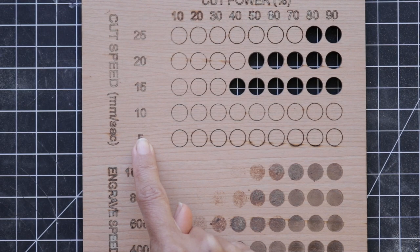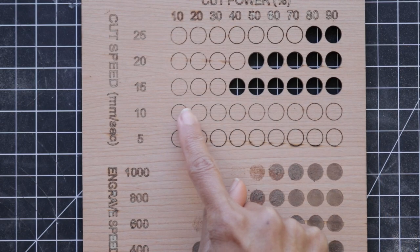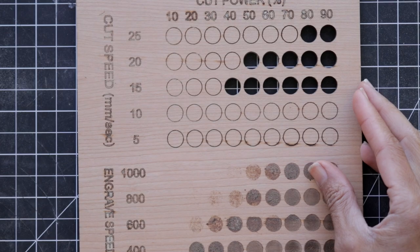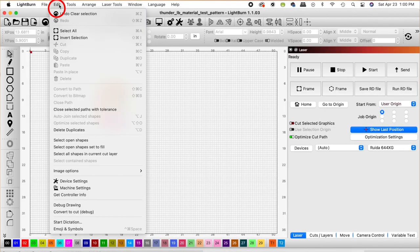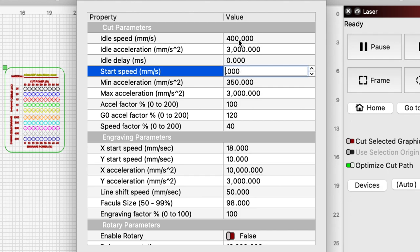Next, you need to make sure your machine settings are accurate. The first few test cards we did were not accurate at all because we skipped this step. Normally when you put in your settings, it doesn't make a huge difference between minimum and maximum values — however, sometimes you notice a tiny defect in an engrave or a cut. Notice on this thin piece of plywood that nothing below a cut speed of 10 actually cut out properly — technically everything should have popped right out. It's because we have to change the minimum speed in Lightburn to something under 5. When the screen pops up, you'll see a minimum value of 10, so change that to 4, then click OK and close.